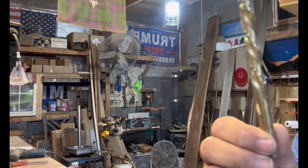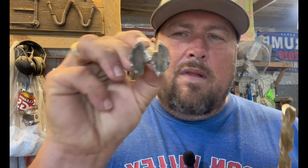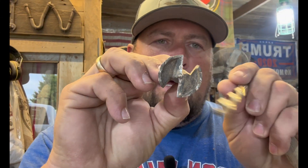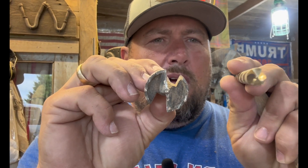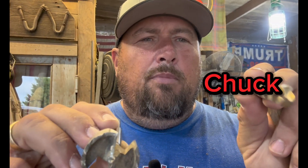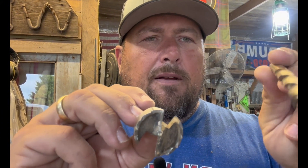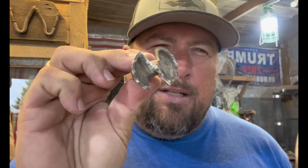Here's a drill bit, and then a Forstner bit — used primarily for wood. Look at that, and that's not even a big one. Now if you're going to drill a hole with that, the biggest you're going to get with a standard drill with a half inch chuck is maybe a three quarter inch hole. With a Forstner bit, you've got a smaller shank and you can drill big holes. I've got these up to three inches.